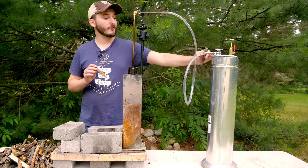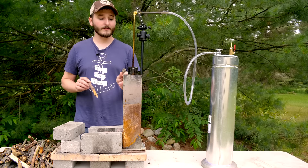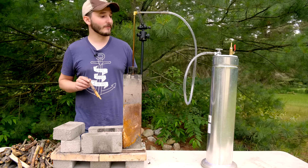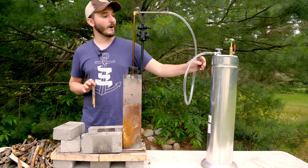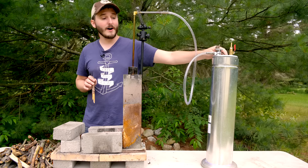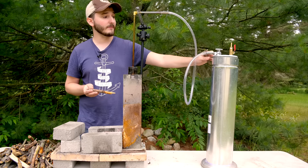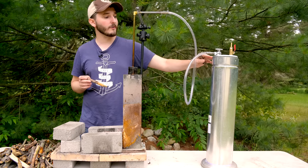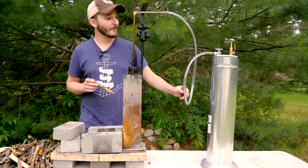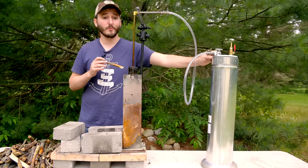The gasometer is now filled with water and ready to go. The stove has fuel in it and the gasification chamber is loaded with sticks. I'll fire the stove up and for the first little while leave the outlet valve on the gasometer open, so the first products from gasification can push out any air at the top of the chamber — since the water doesn't go all the way to the top — and we'll end up with only pure wood gas.